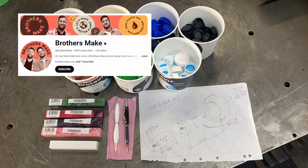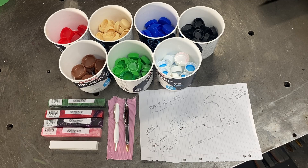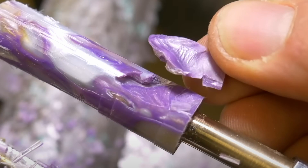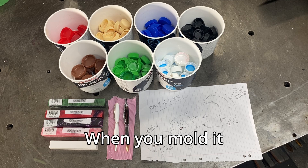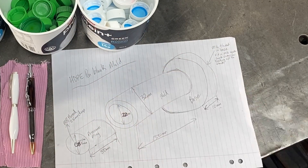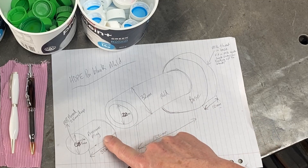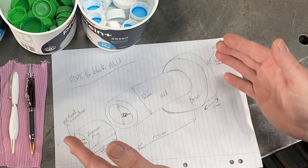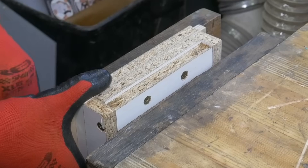I've done a bit of research on YouTube and there are a bunch of videos out there that show you how you can melt down and mold plastic at home. However, one of the issues is that you can get air bubbles or voids in the plastic and that can ruin the item that you're trying to turn. From what I understand it's better to have the plastic under pressure to push out most of the air, similar to how they do it in injection molding. So I'm going to make a mold out of steel — it's quite simple, with a main body with a diameter of 22 millimeters in the middle, and then a plug that goes into that hole and gets squashed up in the vise to apply pressure.